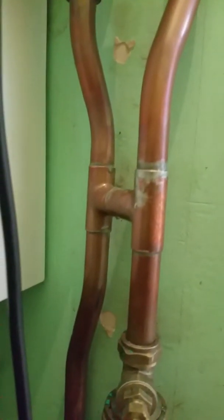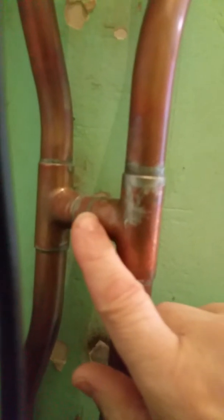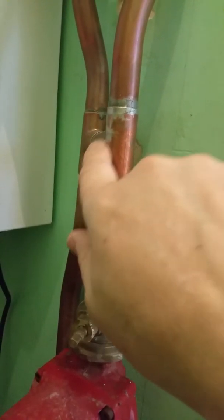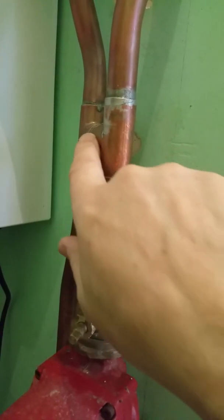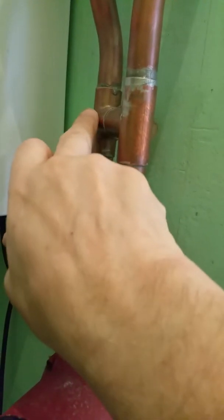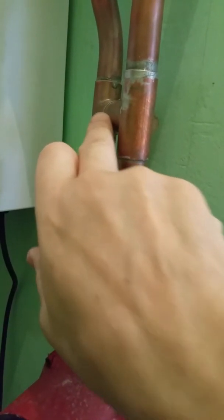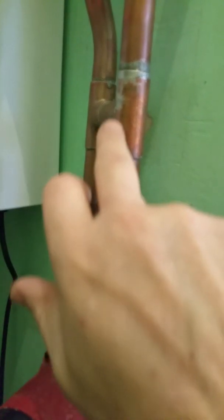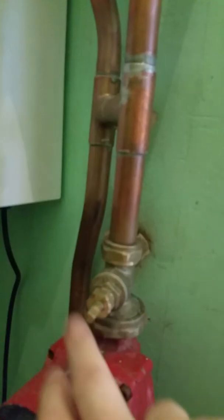So here's the cure. Basically, we've got close coupled T's here — nothing special, just exactly what they say. Here we have the original pump that was running the system and the boiler. Now with half a meter residual pump head just driving across these two T's, once we get to this point, because of close proximity, delta P is close to zero. So there's virtually no interaction between the pumps.